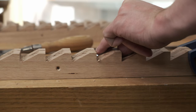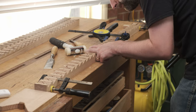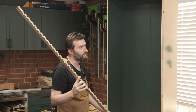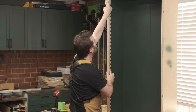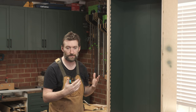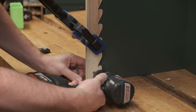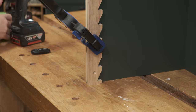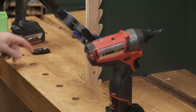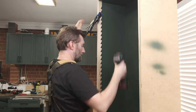The actual angle or size of each tooth doesn't matter as much as them all being even with each other. The sawtooth standards are chiseled out and can now be installed. They butt up against the workbench, flush with the bottom of the cabinet and flush with the cabinet edge — this will be hidden by the face frame anyway. Once both are installed on both sides that gives us the width for the shelves and the depth for the cleats. The screws are really just to keep the standards from tilting since all the force is going to be downward.